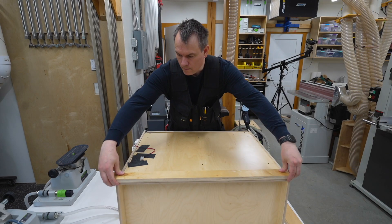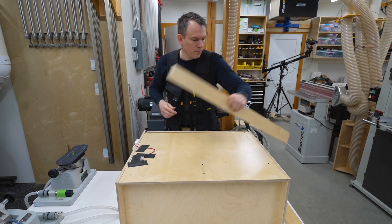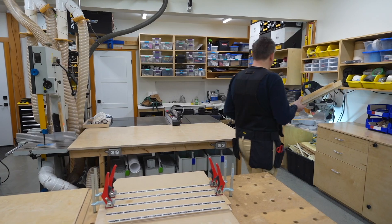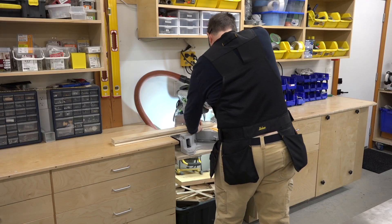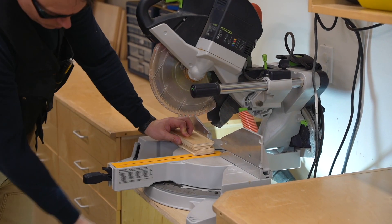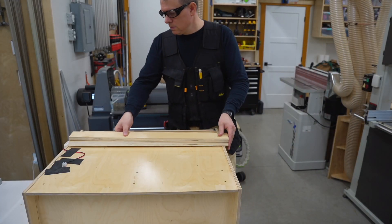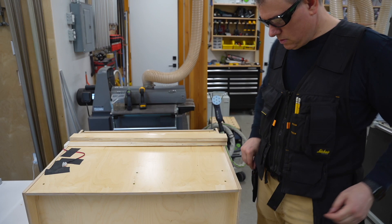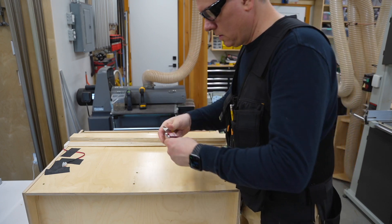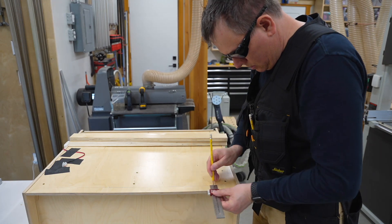The final addition to the desk is to add a French cleat on the back. All of my shelving units in my shop utilize French cleats. French cleats have many advantages. The continuous mounting strips on my walls bridge across studs so that you can place shelves in any location without worrying if you have a stud in a specific location. French cleats allow you to change your mind with your layout of your shelves or tool mounts. I have moved my shelves around several times as I have acquired new tools and my workflow in the shop has changed as a result. I had to make an accurate line to make sure the mounting screws will connect through the back and into the top shelf.